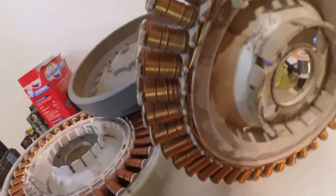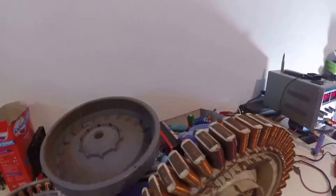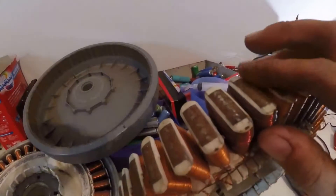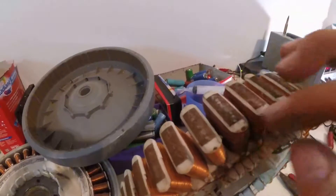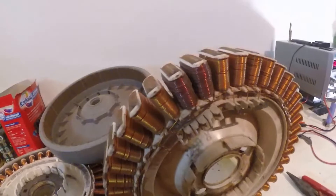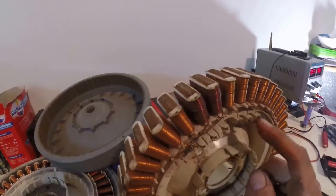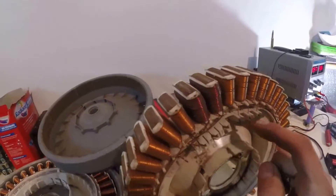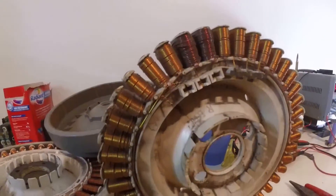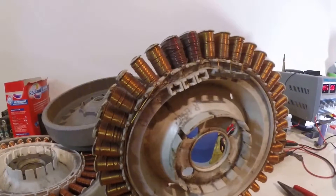He's gone more for the 'use the motor as a generator' kind of approach. He's gone along and knocked all the squarish edges off at the end of each of these fields — decoggged it, as such. You've got a common ground point where all the coils end up, and red, blue, yellow, which is fairly standard for the three phases of a brushless motor.